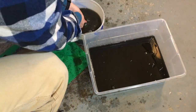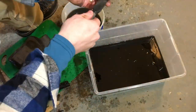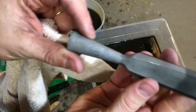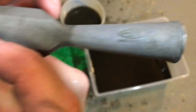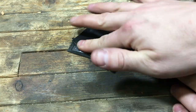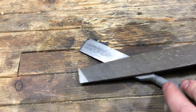After cleaning it up, one of the things I thought was really cool was the way the chisel looked — you can see three different types of metal. The lighter metal on the handle portion, then on the first part of the body it's a little darker, and then the head is even darker, which I assume is due to the higher carbon ratio in the steel. So that end of the chisel is the hardest steel.